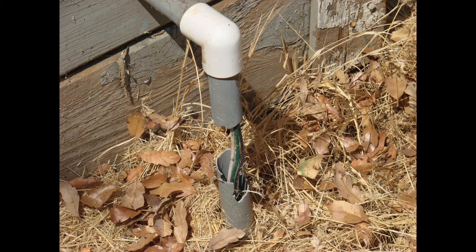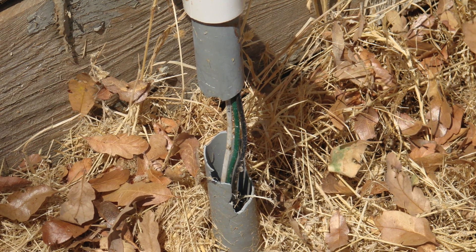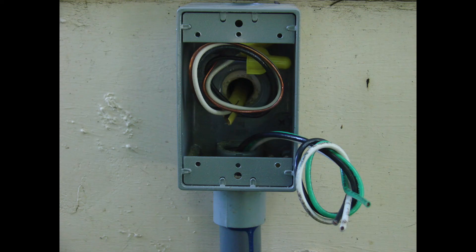With this mistake, at least the person tried to protect the wiring, but unfortunately used a plumbing fitting, which you cannot pull wires through, and the PVC conduit here is probably Schedule 20 — it's really thin. It's typically for data communications use, not approved for electrical wiring exposed above ground. One solution is to install a weatherproof box on the outside of the building, then go down into your underground conduit run with Schedule 40 PVC to protect the wiring. You can have a junction box to make up your wires, and if you want an outdoor GFCI receptacle, that can be done as well.